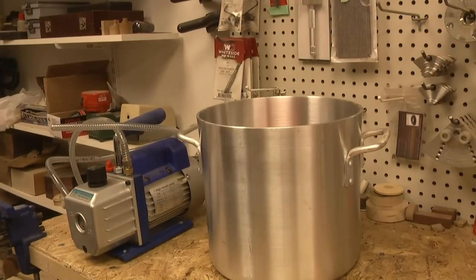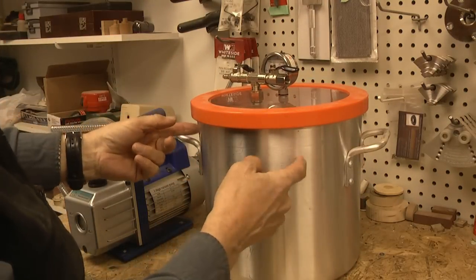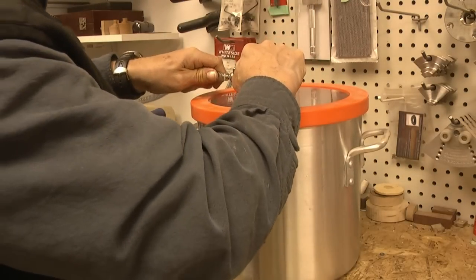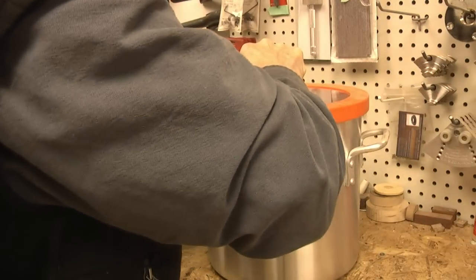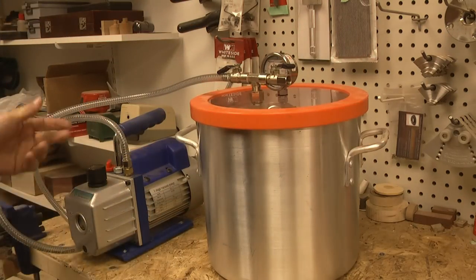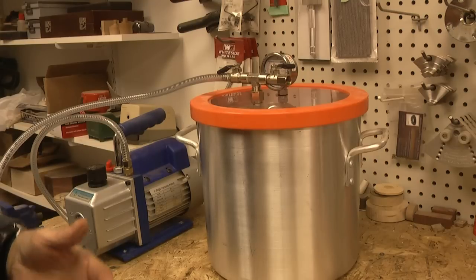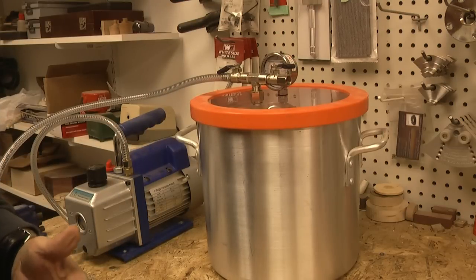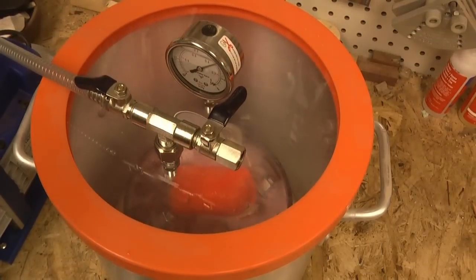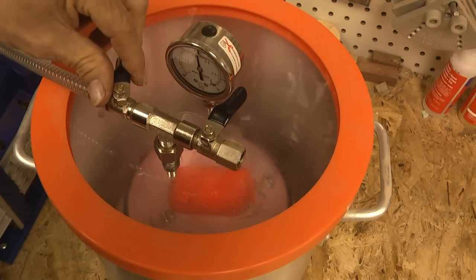This is pretty simple and straightforward at this point. The vacuum seal creates around the rubber grommet on top, and the hose is pretty much a one-size-fits-all — it all came together well. I'll close the door and when I turn it on, you're going to see an immense amount of bubbling as the initial suction takes over. I'll turn it down just a little bit to make sure I don't blow it out of the small container. It'll take about an hour to an hour and a half to suck out all the extra air. I'll turn it down just a little so it doesn't overflow the pot.